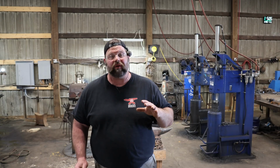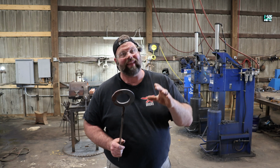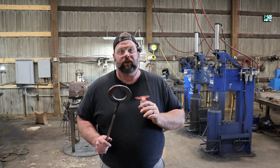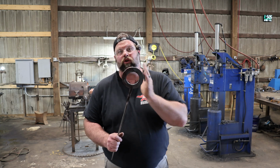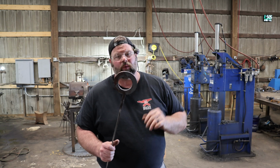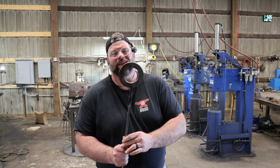From here, we're pretty much downhill. We've got our U made, and now we're gonna get everything set up on the anvil, and that way we can go straight to work as we come out of the forge with our U. Like I said, this part and the vertical member of the cross is going to be warm, toasty. Definitely don't want to touch it, but we're not looking for forging temperature. We just want it a little malleable, a little willing to bend.